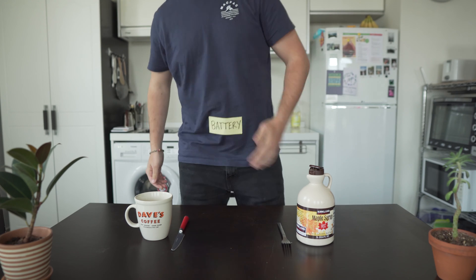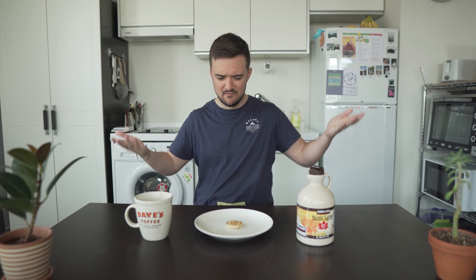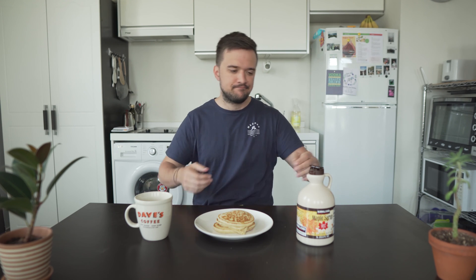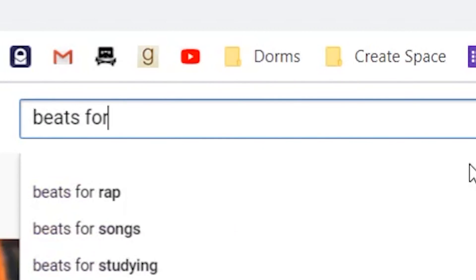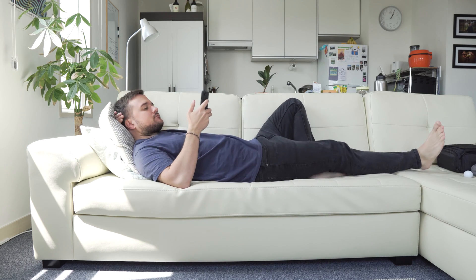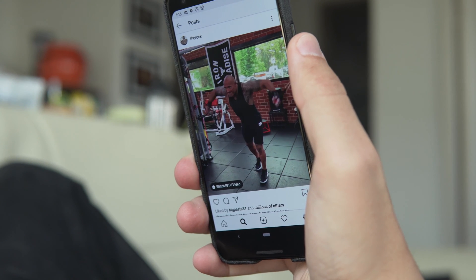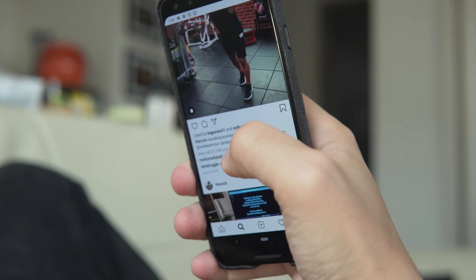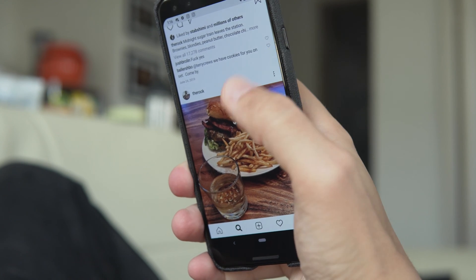Although the processes are very different, I like to compare it to the way that we intake food for our own body's fuel. Both overfeeding and underfeeding your LiPo is not good for the battery's health. It's best to eat in moderation — especially when your battery isn't doing much work and is inactive for an extended period of time, it's important that it only holds a moderate voltage to stay healthy. You don't want to overcharge your battery if you're not going to spend that energy in the near future. If you're about to put your battery through some strenuous work, you want to fully charge it — and as long as it burns through that energy soon, giving it a bit of extra fuel is perfectly fine.